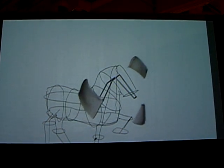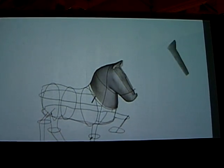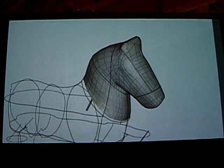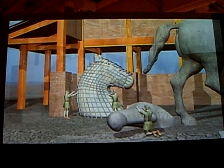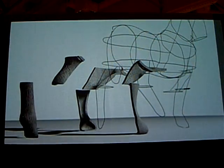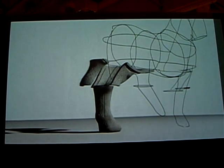The two halves are then opened again and are rotated until the supports of the framework rest on the ground, freeing the casting core. The core for the head is made solidly inside the mold, presumably reduced in thickness with wax. The molds for the legs, which are made of solid bronze, are assembled without force.